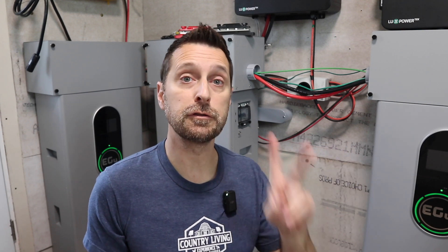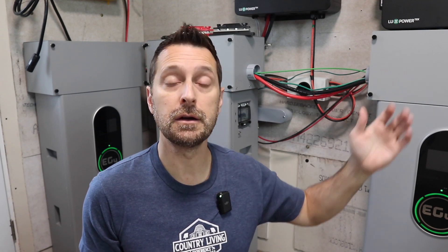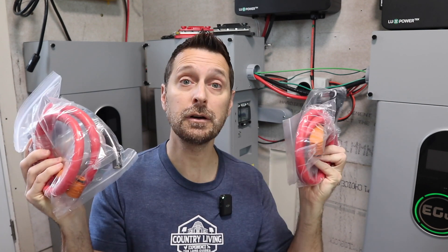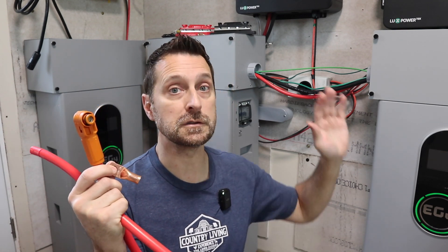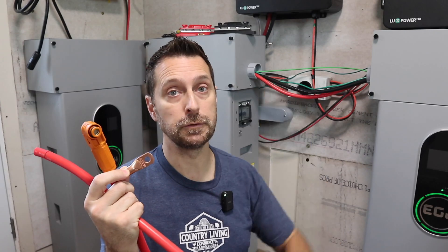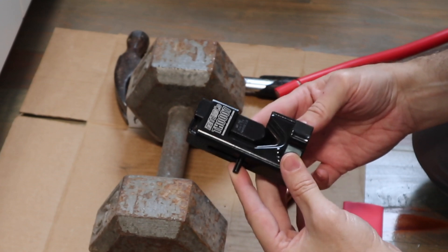Here's the really nice thing: you do not need to buy any extra battery cable. All you need to do is get some extra lugs. That's because each PowerPro battery comes with two sets of two-aught battery cable, so it can connect to things like the 12,000 XP or the 18k PV. If you only have one inverter like I do — the 12,000 XP currently running — then you have a lot of extra cable left over. I'm going to take one set of the cables and crimp on some new lugs on the ends. That will also be useful for the future if I want to switch back to my 6,000 XPs.